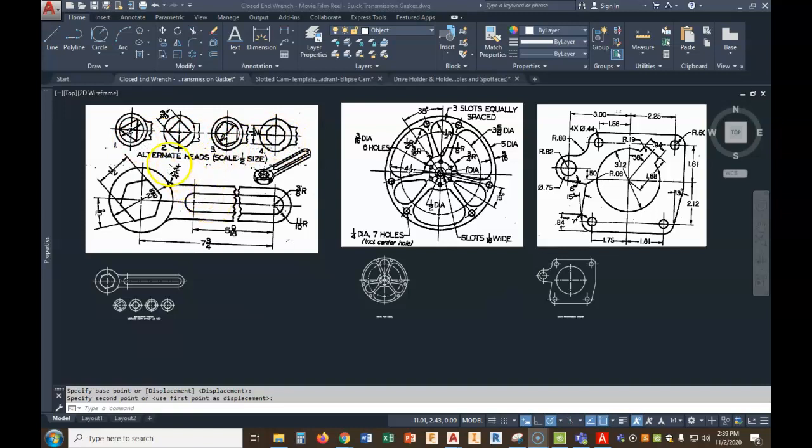And then what we decide to do after that is, is it inscribed like the triangle or the pentagon, or is it circumscribed like the hexagon, square, and octagon? Remember, inscribed just means inside, drawn inside. Circumscribed means drawn outside of the circle. The other term that you're going to hear, of course, is across corners. Notice that the corners of the triangle or the corners of the pentagon are touching the circle, so that is inscribed or across corners as far as your measurements go. And circumscribed is across the flats of the object. So see the flat sides, and here again, flat sides. Okay, so let's get started.